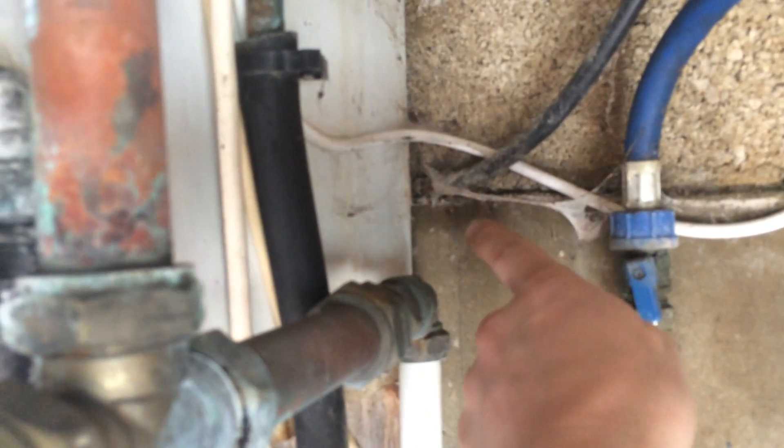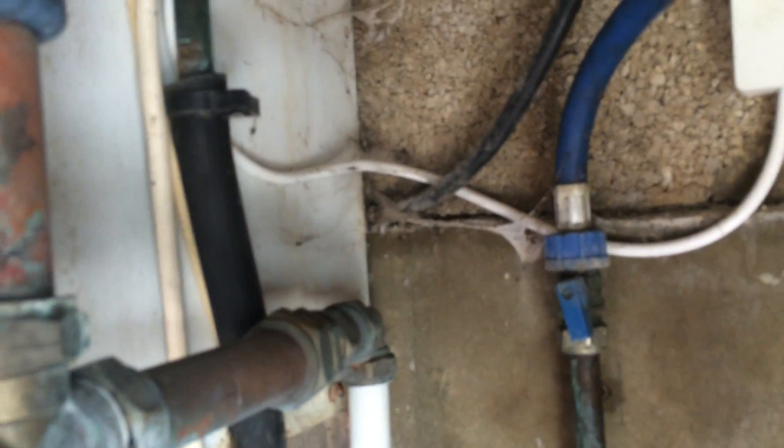So then I got thinking it might be a fault with the cable, because it gets behind that heater there and gets squashed behind there, which I don't like. So I mega'd that and it was fine, but then I cranked it up to a thousand volts. I don't know if you're going to be able to hear this, but let's see.